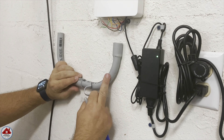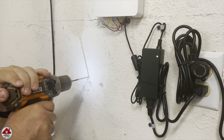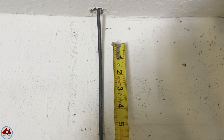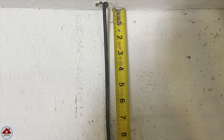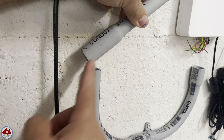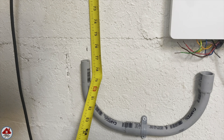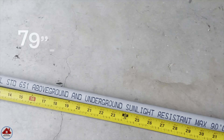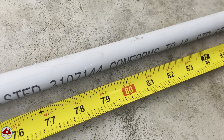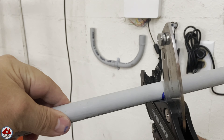Using my same pencil mark to line it up, I place the clamp where I want it and mark the drill holes with a sharpie. I next drill two holes using the hammer setting — you just drill until you punch through, or slightly longer than your screw. Then I place the two screws in the holes and use my Phillips bit to screw them in. It's kind of hard to hold the tape measure right here, so I'm just going to hit the ceiling — it's about three-quarters, so I've got to subtract that. This part of the conduit goes to that line. So if I take my tape measure and hit the ceiling down to the pencil mark, I'm getting 79 inches. 79 minus three-quarters is 78 and a quarter inches. Then 78 and a quarter plus the one inch that goes in the 90 equals 79 and a quarter inches — that's where I place my mark. Then I use my PVC cutters to make my cut.